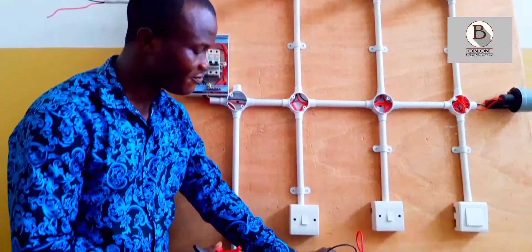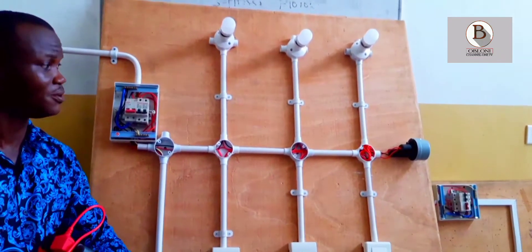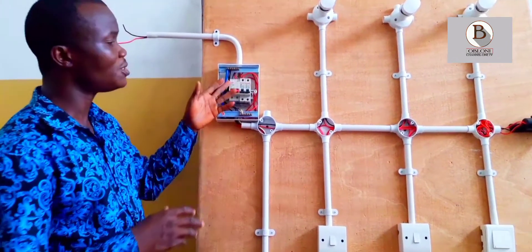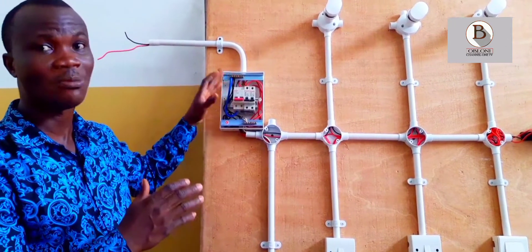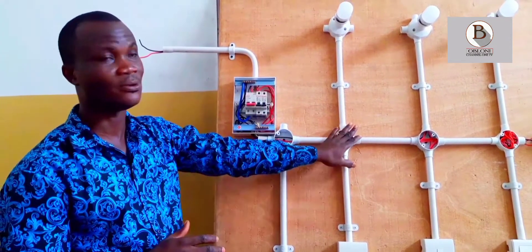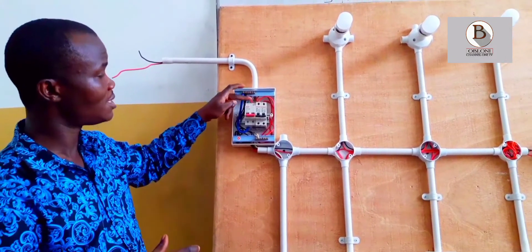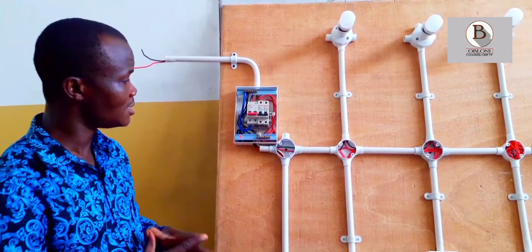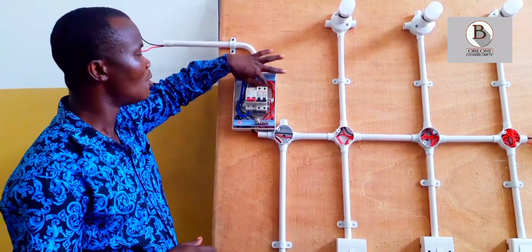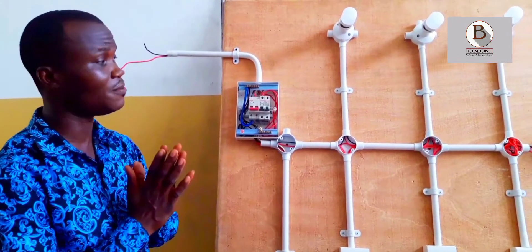In this circuit, we have the power circuits and then we have the lighting system — a power circuit and a lighting circuit. I could have done the test separately between the live cables of the lighting circuit against the neutral, and then separately for the live cables of the power circuit and the neutral. But that would take a lot of time, so I am going to combine all the live conductors — all the outgoing live conductors together to form one.